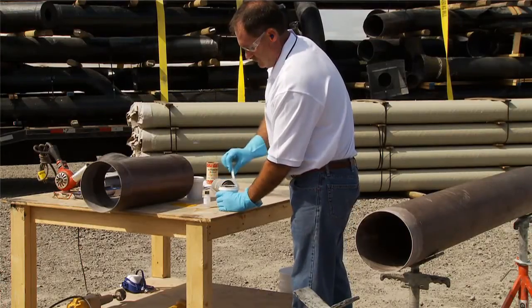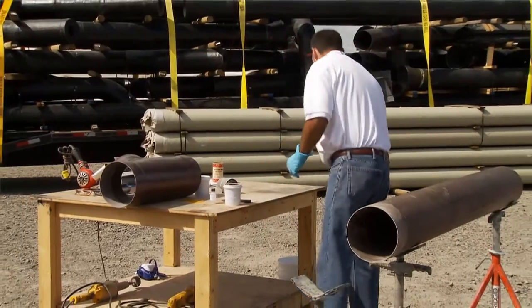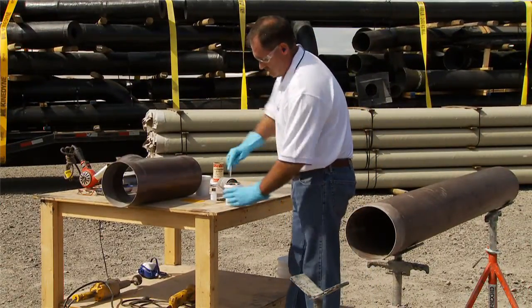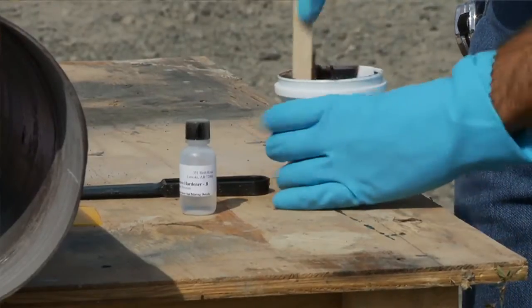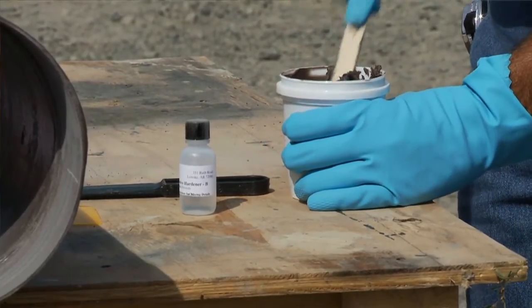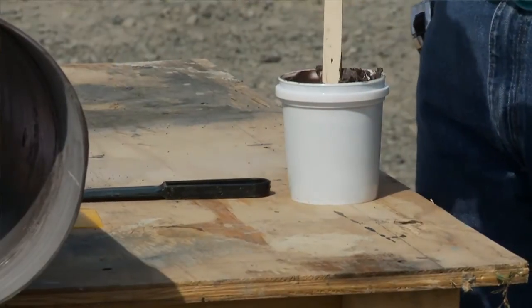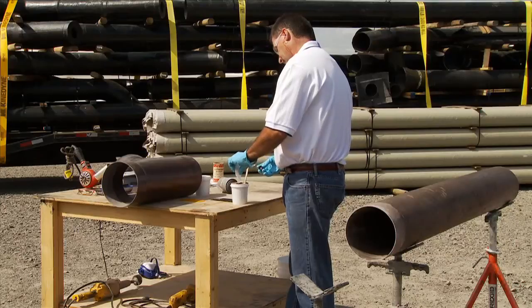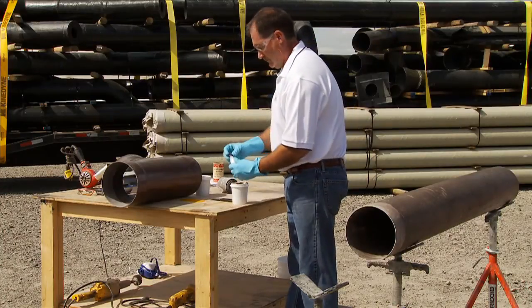Now prepare the adhesive for bonding. When the adhesive arrives in the bulk container, there may have been some settling over time. Stir the adhesive to assure that there are no loose liquids on the top of the adhesive. The mixture is fairly thick, which is necessary for it to hold its place in the joint to gain sufficient strength. It will thin up a bit when the hardener is added.